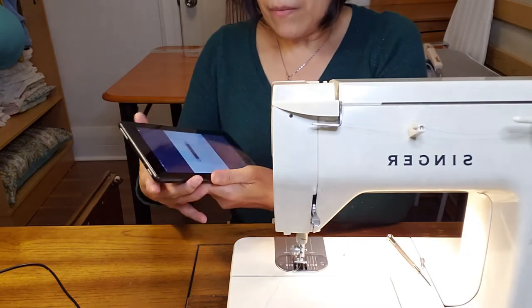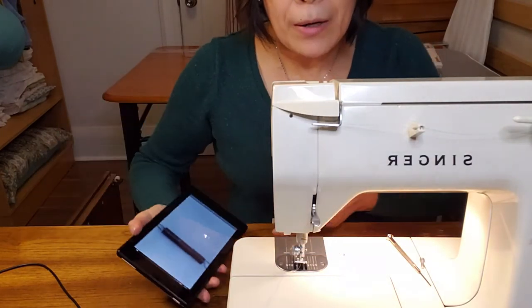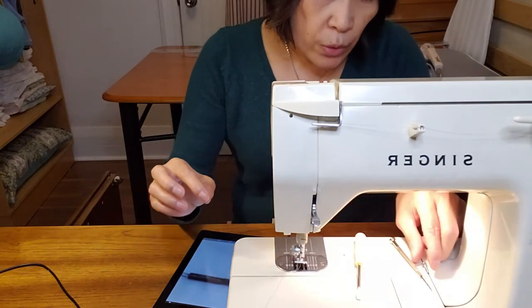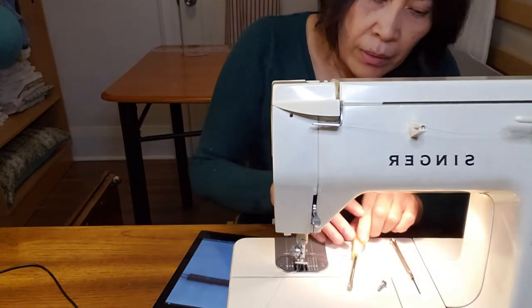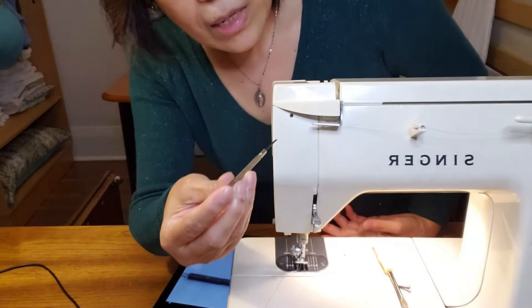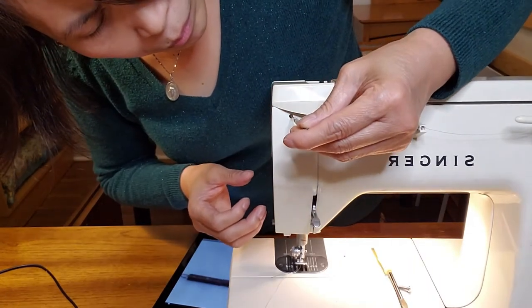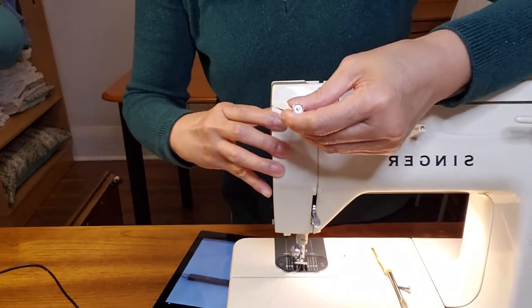To find out where it came from, I open these parts of the machine. I use this flat screwdriver to remove this screw here, and then I use this allen key to loosen this set screw in here — just loosen a little bit — and jiggle this cover.